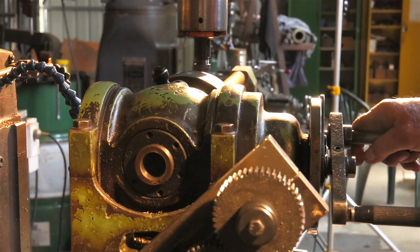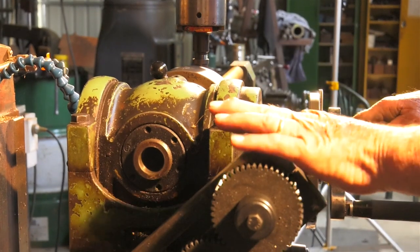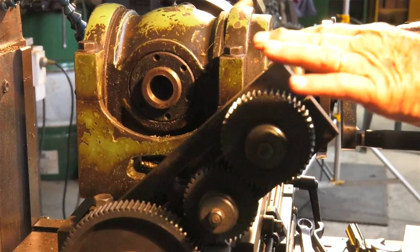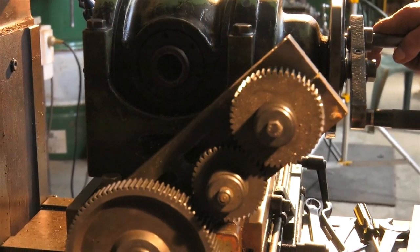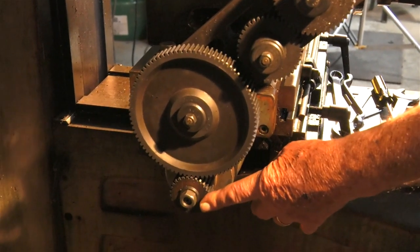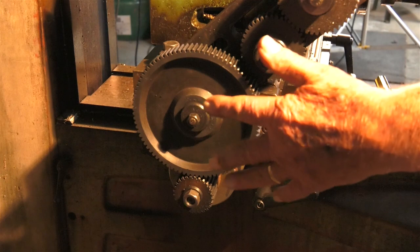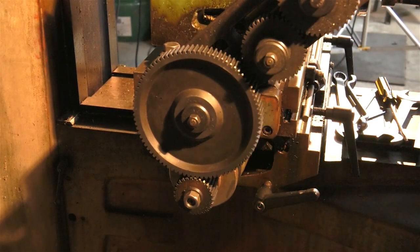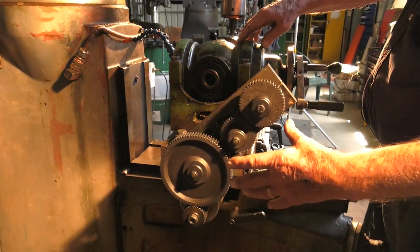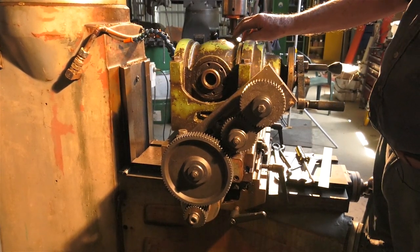But remember, we're cutting a helix, or 20 helixes. So that's where this comes into play. It's what they call a universal dividing head, and it's got all these knobs and gears and things on it that are attached to the spindle or the lead screw of the machine down here, which I've said before is 5 threads per inch. And the trick is to get, as we traverse along on the travel of the machine, an even rotation on the job, which is achieved by this dividing head.